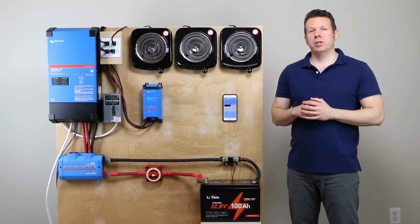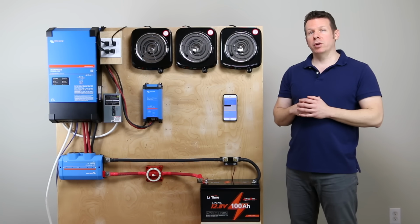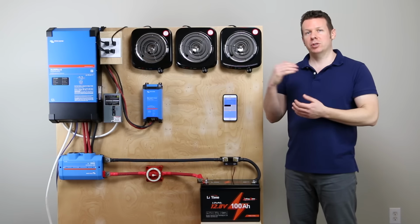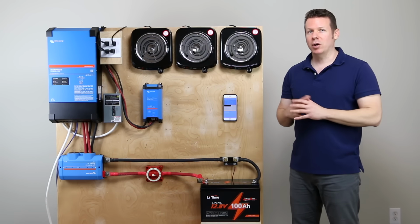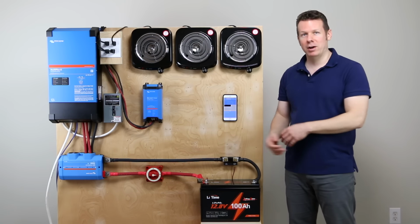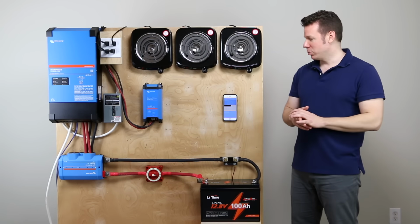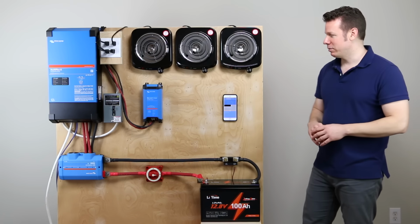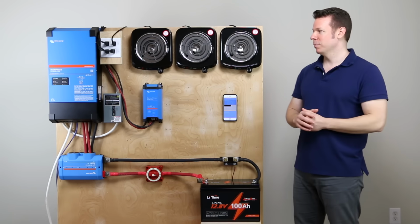So I would say that is definitely a pass on the overload test, and allows you to get those overload situations. But it's not going to go beyond 5 seconds, because if it did, it could get hot and then it could start a fire, and now we have larger problems. So it gives you a little bit of overload, but cuts it off after 5 seconds, which is perfect.